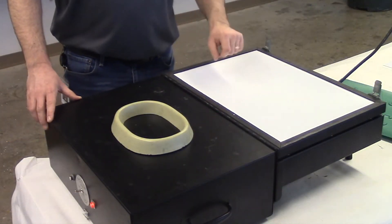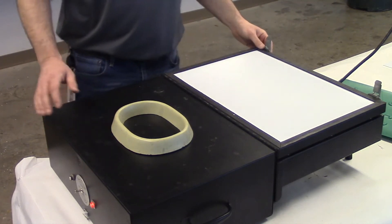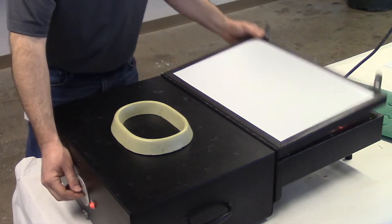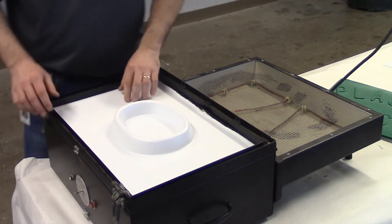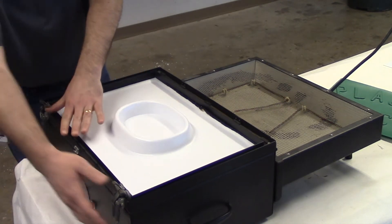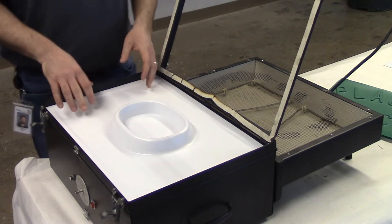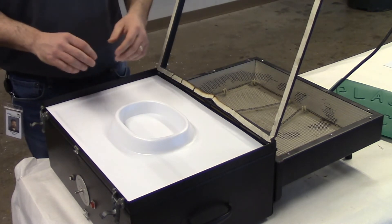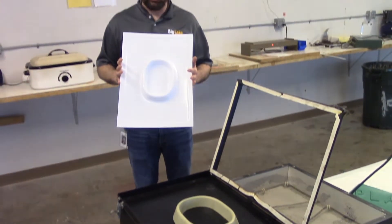It's been about a minute and I can see I've got that bounce back. My finger is starting to even sag here so I'm going to want to hurry up. Flip this over, close the seal, and hit the vacuum switch. The sheet is thicker than the other sheet I was using but it's still fairly thin plastic and it cools off really quickly. Now I have my pet food tray. I still need to trim off this excess to make a good looking product to turn in.